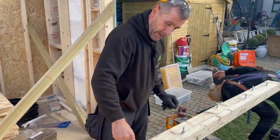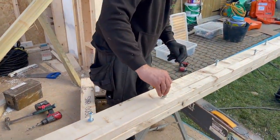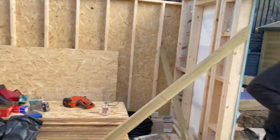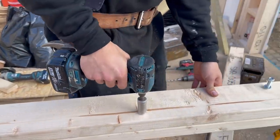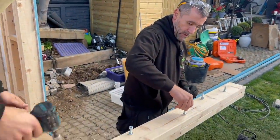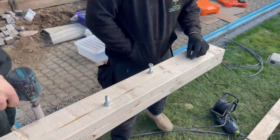Like I said, this roof is about 4.1. Because we're limited with the timber we can use, we've found structurally this is the best option to span that distance. We don't need to put a flitch beam in every one. A flitch beam every other one is more than sufficient. As you saw, me and John stringing off it there was enough to not cause any deviation in the timber, and there's probably 30 stone between us both.